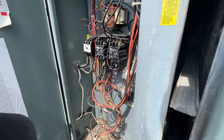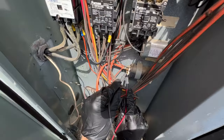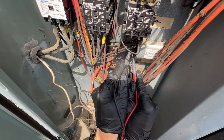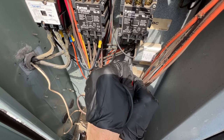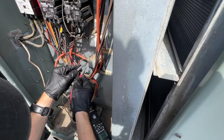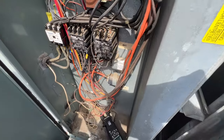I got my meter out set for capacitance. I disconnected both the fan wires off the capacitors and I'm just going to test those. That's 9.2 — it's rated for 10, still within 10%. This one is 1.3. So we need to replace at least one capacitor, but I'd like to just replace both to be on the safe side.